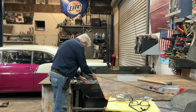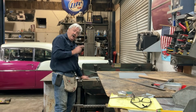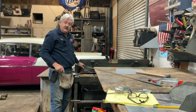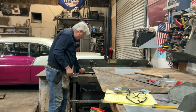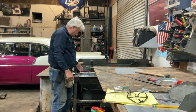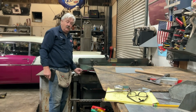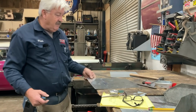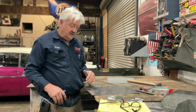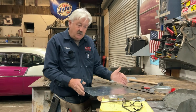I wouldn't come over to the shear and measure the 4. I always want to measure the keep. So I wouldn't take this 20-inch long piece and cut 4 inches of it off. I would measure my 16, because the piece we cut off is probably going to end up in the scrap barrel. So it doesn't do us any favors to measure a precise measurement on something that's going in the scrap barrel. What we want to measure is our project. Measure the keep. Measure what you're going to keep.